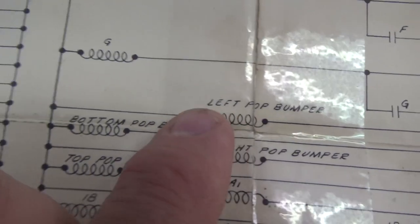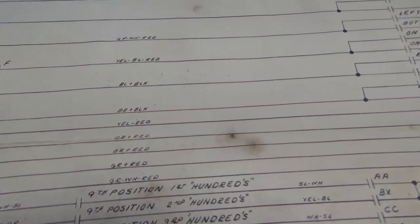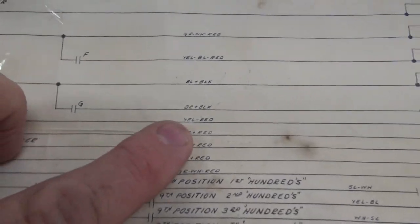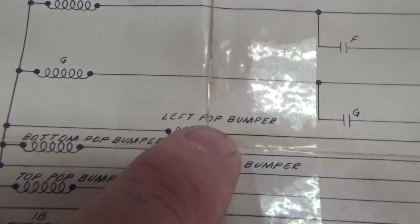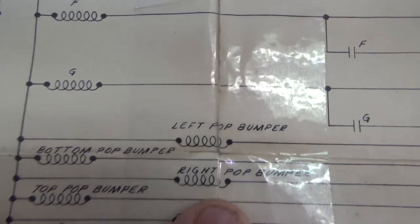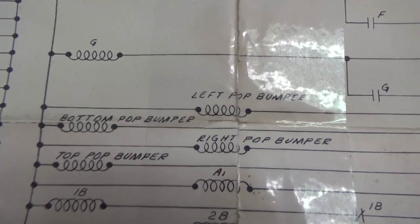It's because if this coil is shorted, you are connecting neutral to hot. Just pss, pss, pss, pss, and it'll spark like crap. So this coil is probably shorted, but we can check it. If you look on the left, it's connected to the common, the neutral, and on the right, it's not connected to anything other than that switch. So you can check it in circuit, because that right side isn't hooked to anything. So we'll check it with a multimeter. If you're down below about 2 ohms, it's shorted and you need to replace it.